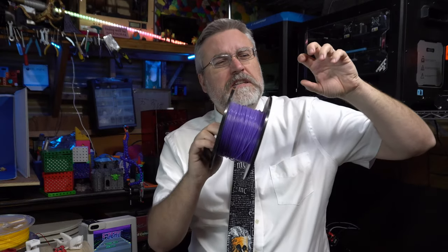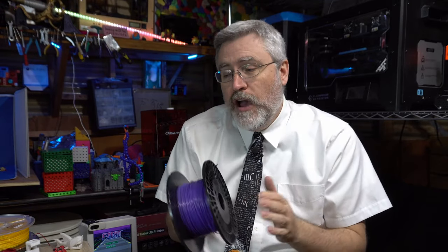The criticism was: it melts at a lower temperature, you could put it in your car on a hot day and it'll warp — you don't have that problem with ABS. And it's solid, but if you bend it, it breaks too easily, whereas ABS will just bend if you stress it. While those things were true, once I converted over to PLA, I realized it is more than sufficient for almost everything you're going to do, and it really does 3D print incredibly easily.